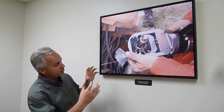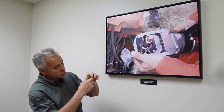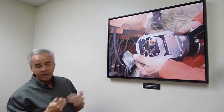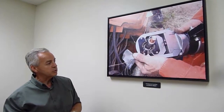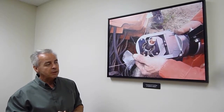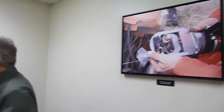And so it's a 45-ton tool that just squeezes the heck out of that connector. And it squeezes it circumferentially down. They call it a radial swage, but I like the word circumferential better because it puts the same force along the entire outside of that circumference and makes it circular when it's done. So that's a key part of making that seal be very effective. So we own a lot of those swaging tools that aren't typically used in the small cable environment. They're typically used in the big stuff in substations. So it's a special application for us.